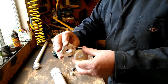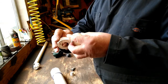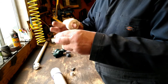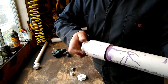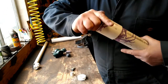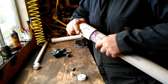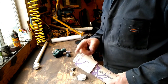For the Teflon tape, take about three or four turns around the threads, winding clockwise so it won't come off when you're threading your fittings in. You don't have to make them super tight — we don't really care if it leaks a tiny bit since there's air pressure on it all the time. I'll just finish putting in all the threaded bits.